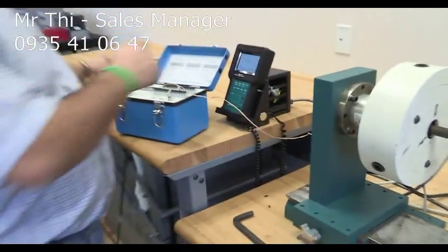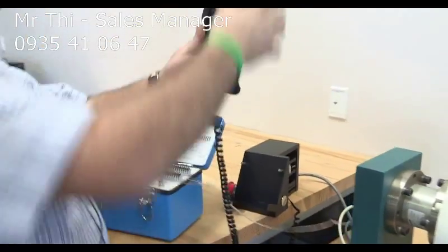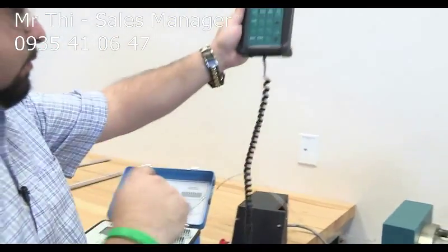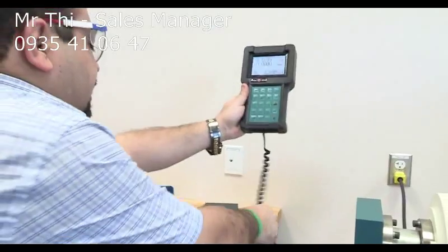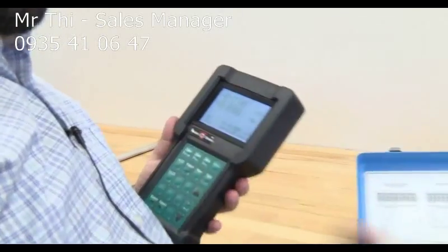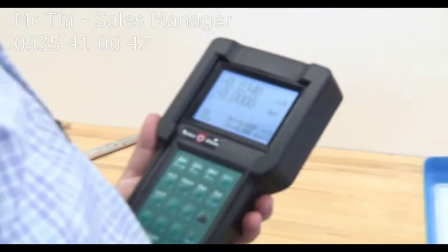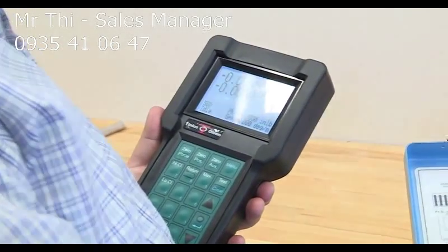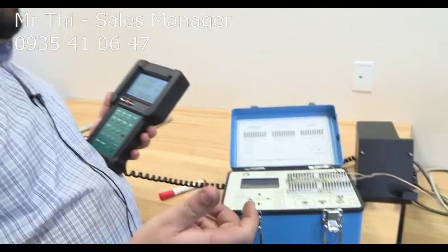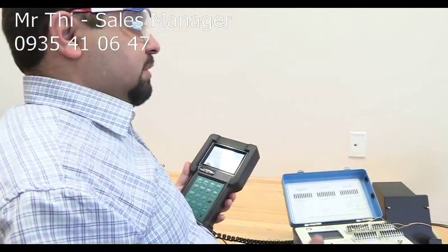And the way this works, it's really easy. I'm going to apply torque. I'm going to load it all the way to 5 or 10 degrees. Stop, read the torque, and read the strain. It's your call how you want to do this. But basically, you can do 5 degrees increment or you can do 10 degrees increment.